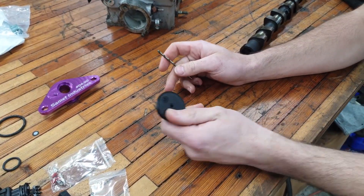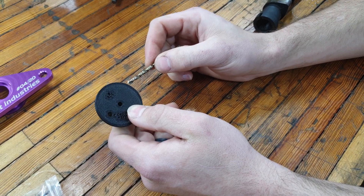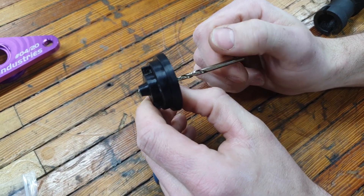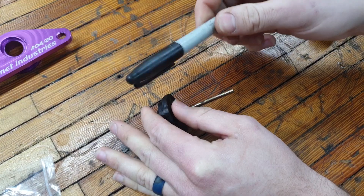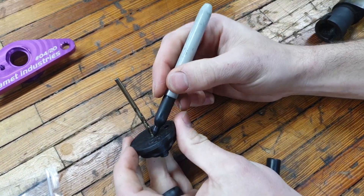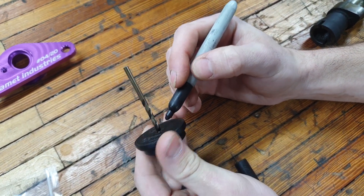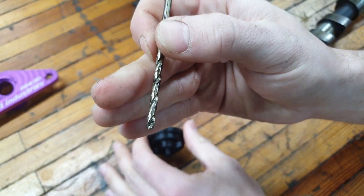Take the drill guide and the drill bit included in the kit. If you use the middle hole, just stick the bit in until the tip just starts to poke out towards the end - that is how deep the hole needs to be drilled. I'll go ahead and mark the drill bit with a Sharpie to know how deep to drill later. You can also use a piece of tape or an actual drill stop. So there we go - I have marked the necessary depth on the drill bit.